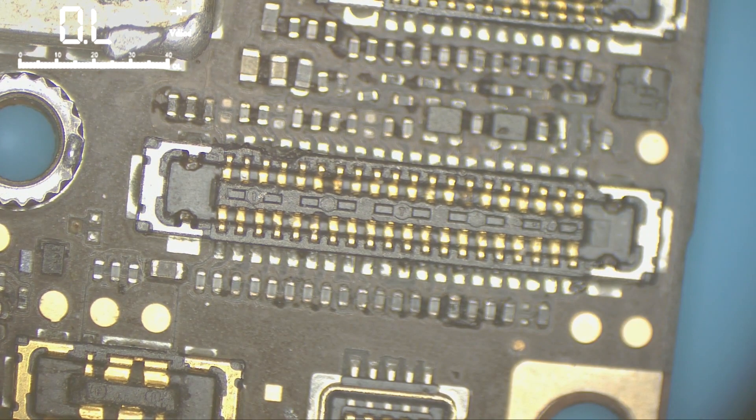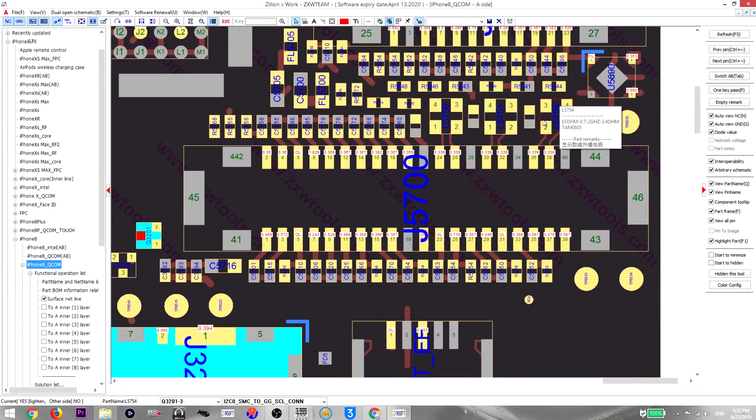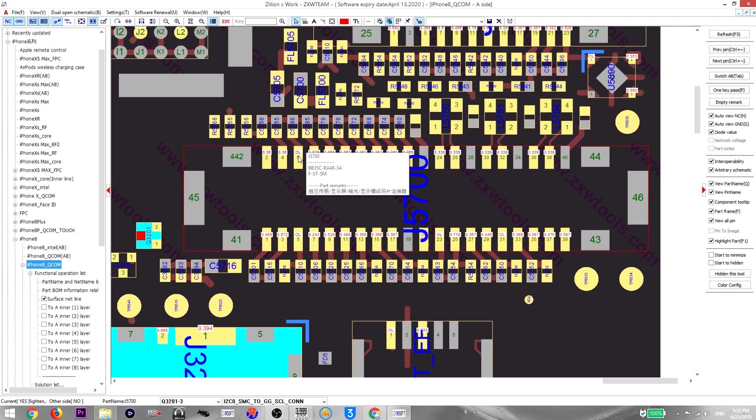I can see I have more than five or six traces with no resistance value, and they should have one — that is not correct. So maybe a component in series is disconnected, or maybe the chip itself is disconnected. Let's go to ZXW and measure again one by one. The first one is giving me a correct value, but the second and third — pin number six — is giving me a value it should not give.